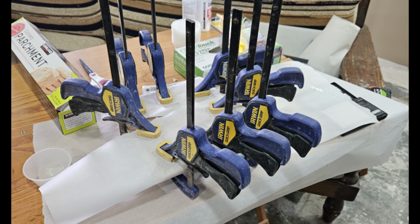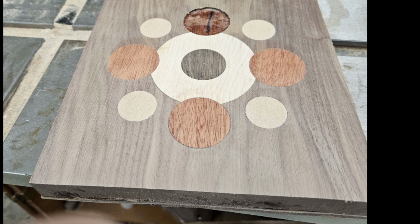With that preparation, I could epoxy on a piece of maple veneer and another 1/4 inch thick piece of solid walnut. Then clean up the top side again at the drum sander. It appears that one of my inserts is below the surface. That is not a problem since I will be hollowing this side.